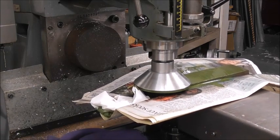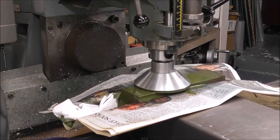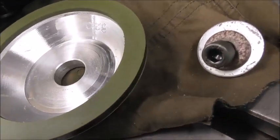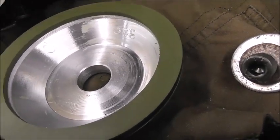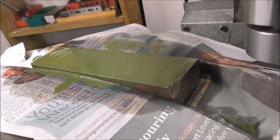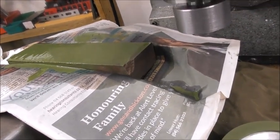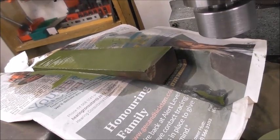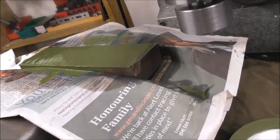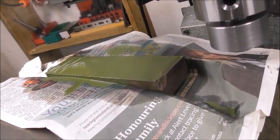You can hear it's not cutting intermittently now — it's already running true. Wow, look at that surface — it's running true and it's beautiful. It's a generated flat surface. That's the best part about it: you're generating a flat surface on the diamond wheel and simultaneously generating a flat surface on the oilstone. Believe it or not, both are being achieved at the same time. What's happening is the oilstone is taking the bond out between the diamonds, eventually the diamonds become unsupported and get ripped out into the slurry, while the diamonds are cutting down the oilstone simultaneously. One is assisting the other and you're getting the perfect end result.